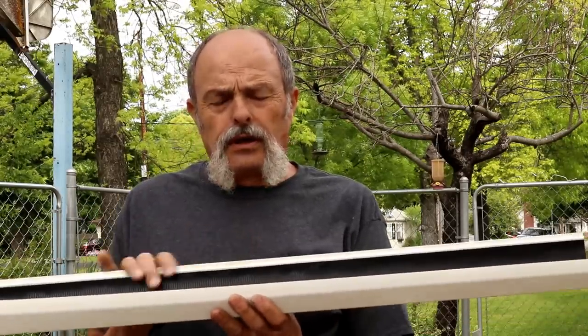Basically that's it. One thing I want to say is you have to classify your material. I would not run anything that sits on top of a 20-mesh screen or larger, because these ripples are fairly small and shallow. If your material is too large it'll just bounce over the top of the ripples and go right out. Anything 20 mesh or larger you should be able to just pan out and pick up your gold. Also, when you run them you have to classify the material and run each classification separately. I was going to show how to set these up and run them in this video, but it's already too long and my sunny day is going away fast.